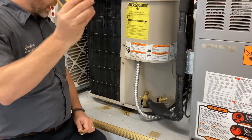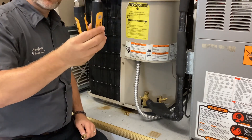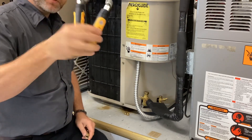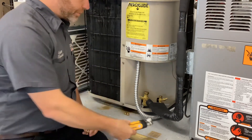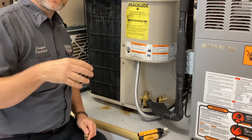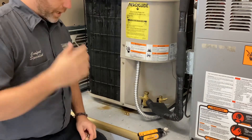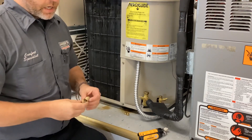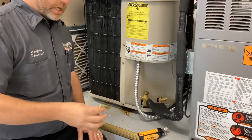You can charge with digital probes — they do not come with a charging tee or anything like that. Everybody that uses them knows they are very handy and everybody wants to be able to do it. But we have to make sure there's no chance of any contaminants, air, or moisture — which become a non-condensable — getting in there, so you're going to have to make sure you do it right.